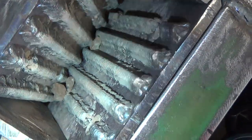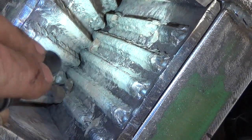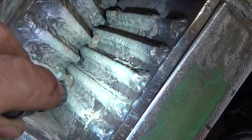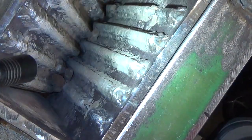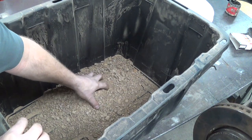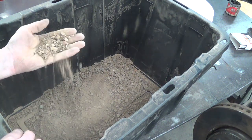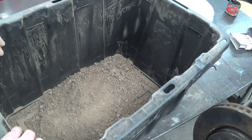What's left in there is just a couple little rocks that don't have the nip angle quite right. It would have been better to have the jaws a little bit closer together on top. I made this as wide as the book said I could get away with, but oh well. This is the material — you can see how fine it's crushing it. It's kind of a sandy type of stone, but this is definitely half-inch minus. It'll go through the impact crusher really nicely.